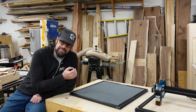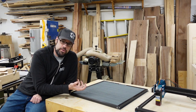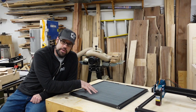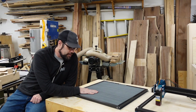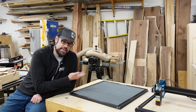However, you run the risk of having uneven support, and parts may be falling through those thicker webbings of the cutting sheet or the cooling sheet. This will support smaller items so they don't fall partially through and get in the way of your laser head. So again, that's one of the benefits: providing a very open but flat surface that provides that consistent focus